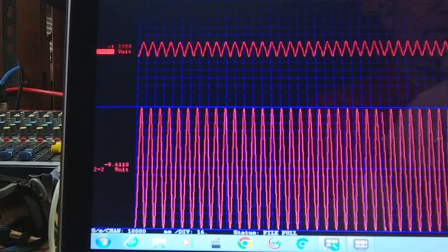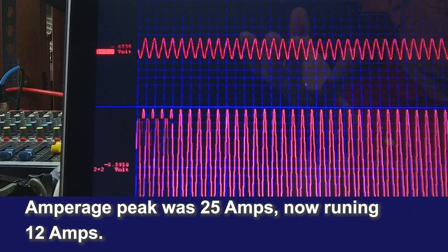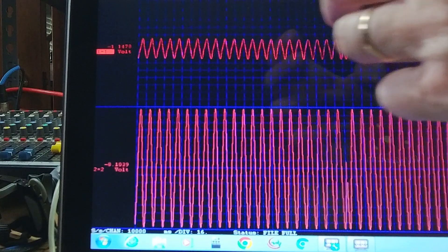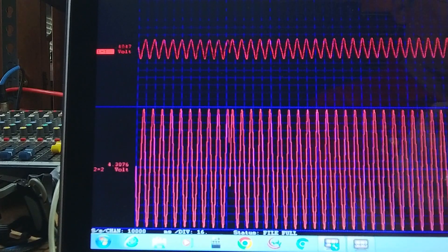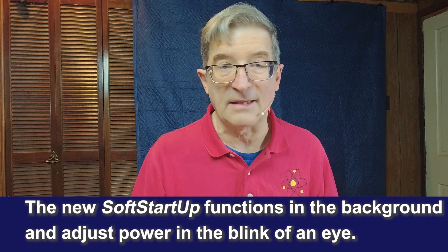You can see that was my first startup inrush — the thing peaked out at probably 25 amps, and now it's running about 12 or so. The current is on top, the voltage is on the bottom. This happens in the blink of an eye — it's a quarter-of-a-second interval. The soft starting doesn't take two or three seconds; it takes one-fifth of a second to happen. I'm Mike Sokol from RV Electricity, thanks for watching.